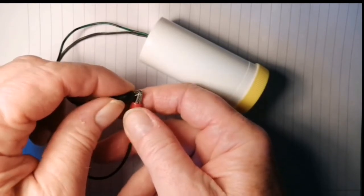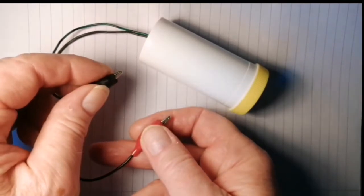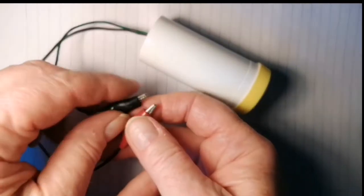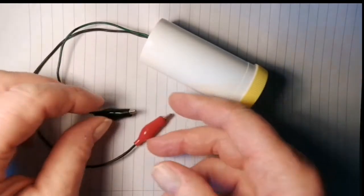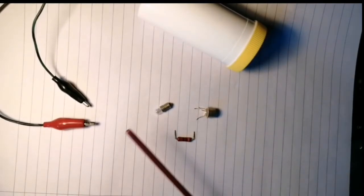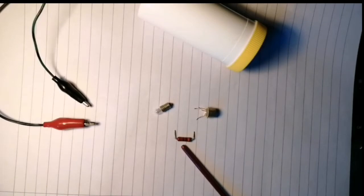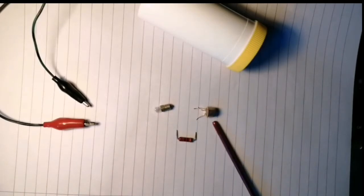Now, if you put a short circuit, squeak. If you put a 10 ohm resistor, squeak. Put a diode junction, squeak. All the same squeak every time. You might think you've got continuity, but what you might be measuring is a low value resistor, or a bulb, or even a germanium transistor junction.